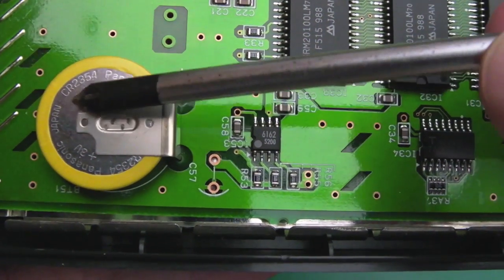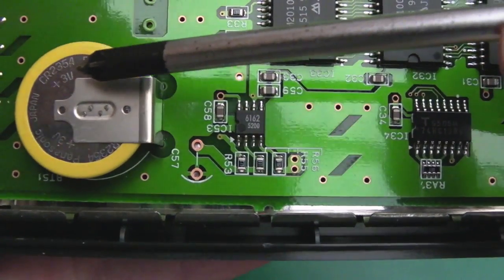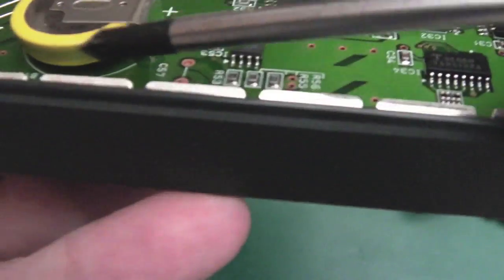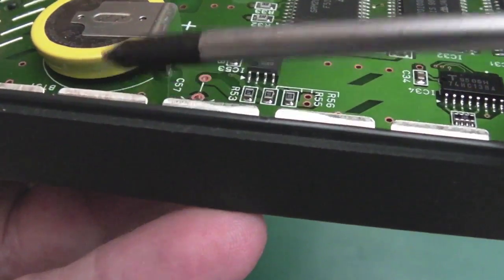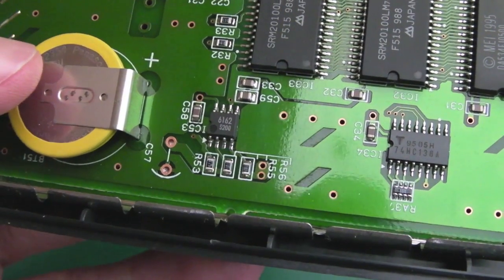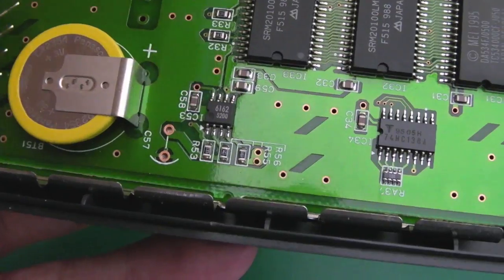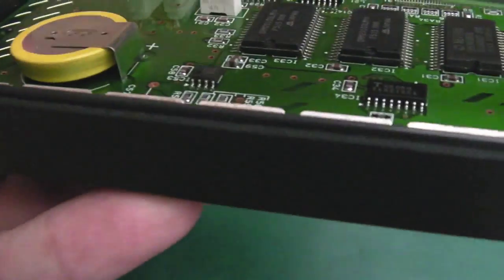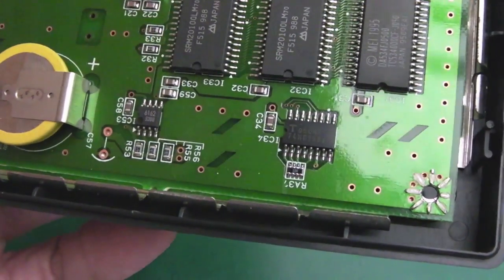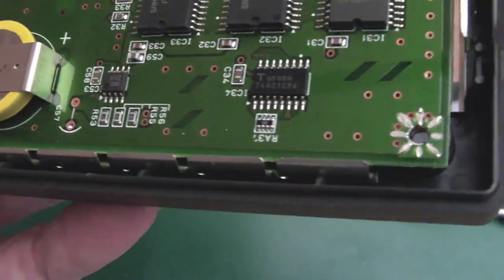It looks like a CR2032. It looks like it says CR236 25664, which is a bit unusual. It's 3 volts. It looks like, oh, it's a bit bigger. Can you see it's a bit deeper than a 2032? So yeah, and that would make sense with the 6.4. It's twice the height. So it is a CR2364. But yeah, I could swap that out with something similar. I'll measure it in a minute just to make sure it's still 3 volts. It's probably okay, I would think.